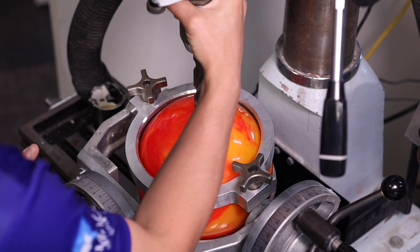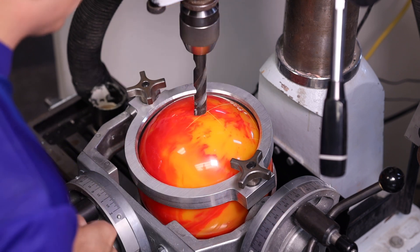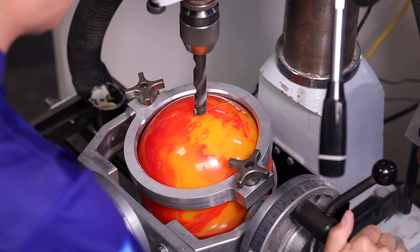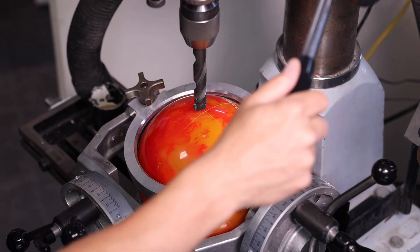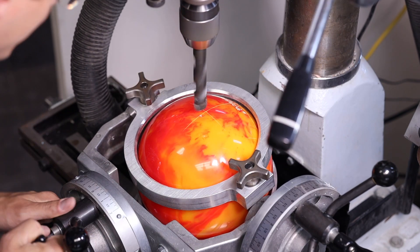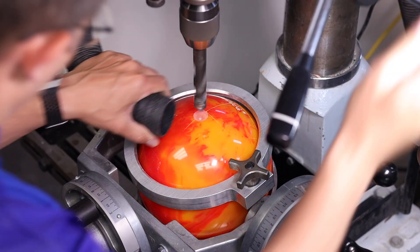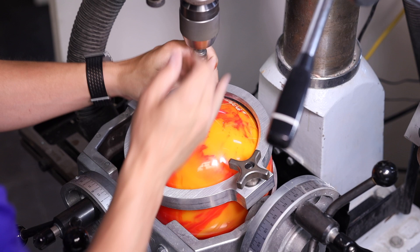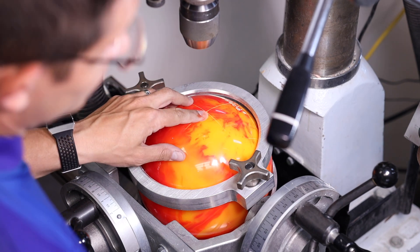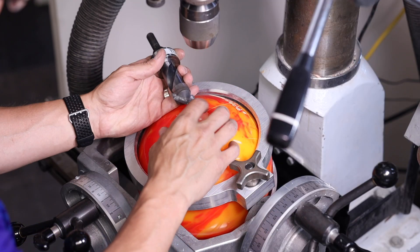I'll bring the 15 sixteenths drill bit down close to the ball and pivot it so I am at my cut line. If I had a four inch span, this would be two inches from my grip center. What we want to do is really center that drill bit on that cut line. Once locked in and confirmed on the cut line, we're ready. This is my one and a half inch drill bit, but I prefer not to start with this to keep it sharp. So what I suggest is to take something out of your drill bit rack that doesn't really get used much — like a one and seven sixty-fourths — and start the pilot hole with that. This drill bit does all the grunt work.